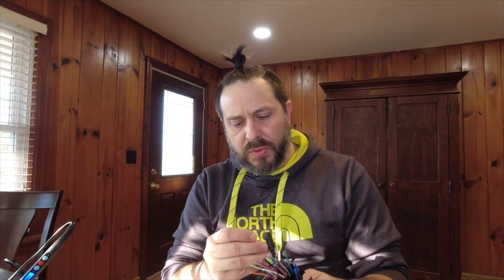Stage two involves building our wiring harness. This is the wiring harness that came with the new aftermarket stereo, and this is the wiring harness adapter I got from Metra that fits my 2002 Chevy Astro. You can't just hook the vehicle's wiring harness right into the radio — look at the difference in these plugs. This one goes into the radio and this one goes into the vehicle wiring harness, so you've got to have both of these. The one comes with the stereo and the Metra adapter you have to buy separately.